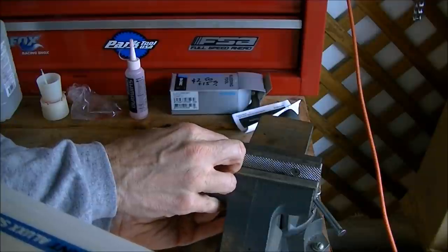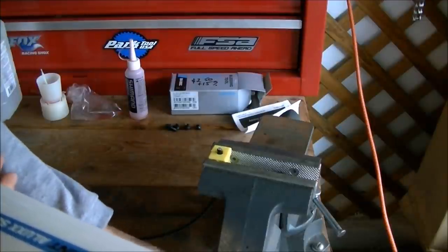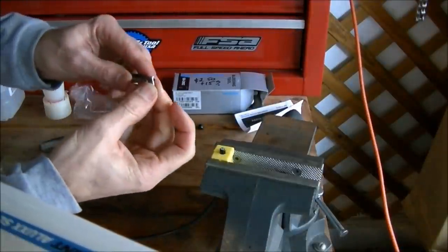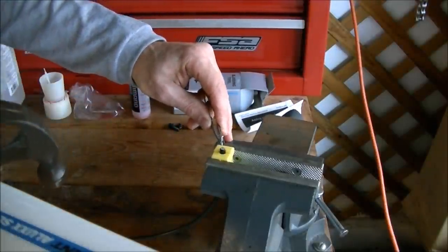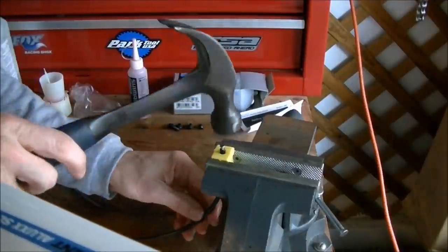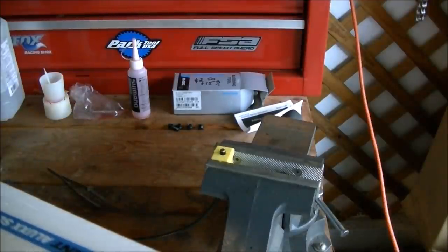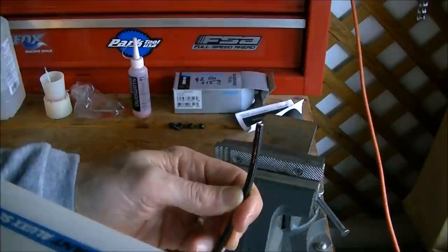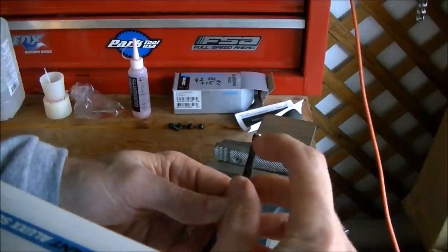I want to leave just a little bit of housing sticking up, and then I tighten the bench vise — not crazy tight, but enough to hold it in place. Now it's time to hammer that little insert down inside. This is where the tweezers come in handy. I'm going to put it over the hole, hold it in place, and just tap it down in there. You don't need to whack it really hard, just get it down inside. You can see the connector insert is now flush with the housing — it's really important there's no gap between the connector insert and the housing; it's got to be completely flush.